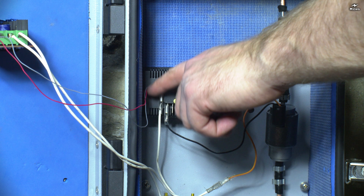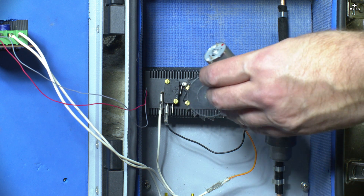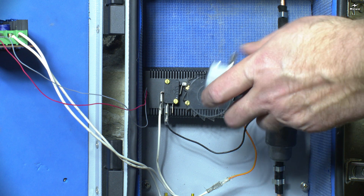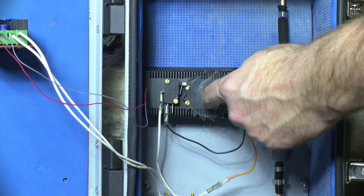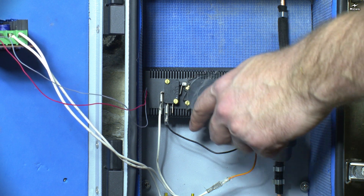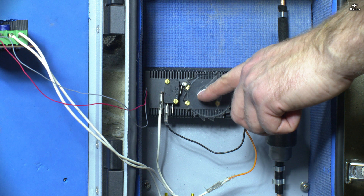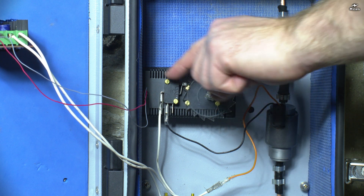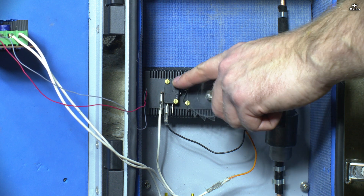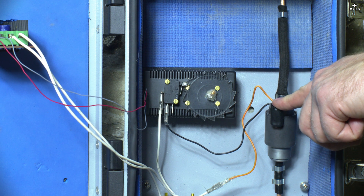If you can see this black plastic box here, inside is a little motor and gearbox combination that looks identical to this spare one I've got here. When electricity is applied to the two terminals, the output shaft spins at about 20 RPM, meaning it takes approximately three seconds for the output shaft to do a full rotation. You can see glued on the end of this output shaft here is what looks like a saw blade that I've cut out of a piece of clear perspex. As this disc turns, the teeth engage and disengage with this micro switch here bolted onto the case, and the micro switch going on and off effectively creates a pulse to the dosing pump to send fuel up the line to the stove.